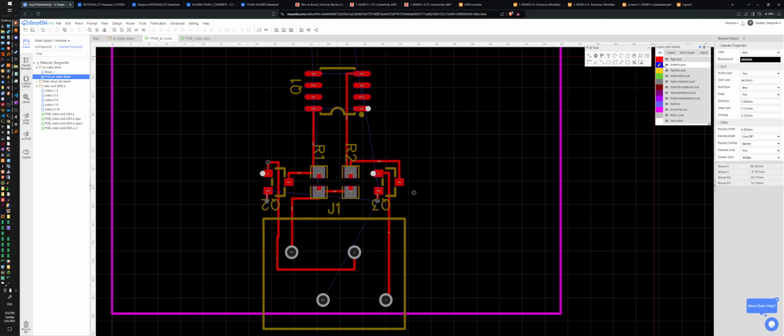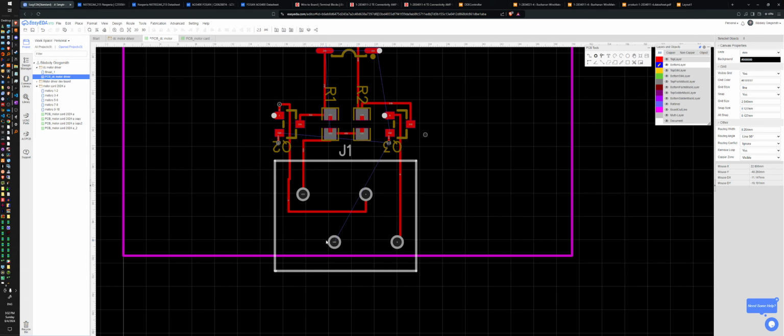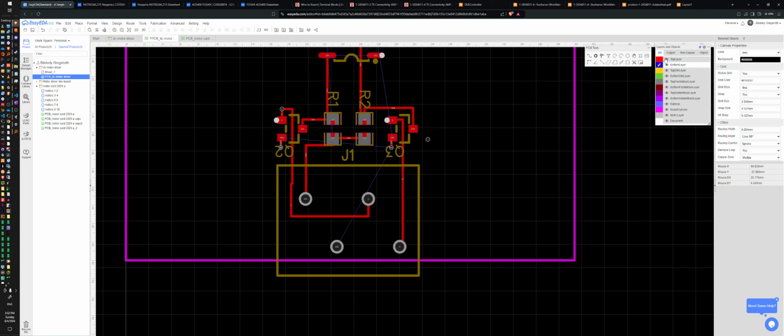Let's make you a thick layer. No. Oh, yes, I probably would want 4 layers for that. So normally, what they would do is have everything coated in copper for power, everything coated in copper for ground. But on a 2-layer board, that might be a bit harder. On a 4-layer board, sure, no problem. But I might just do the lazy way and just have really thick traces. That's what I'm going to do. So instead of 0.254, let's do 3 millimeters. See how big that is.